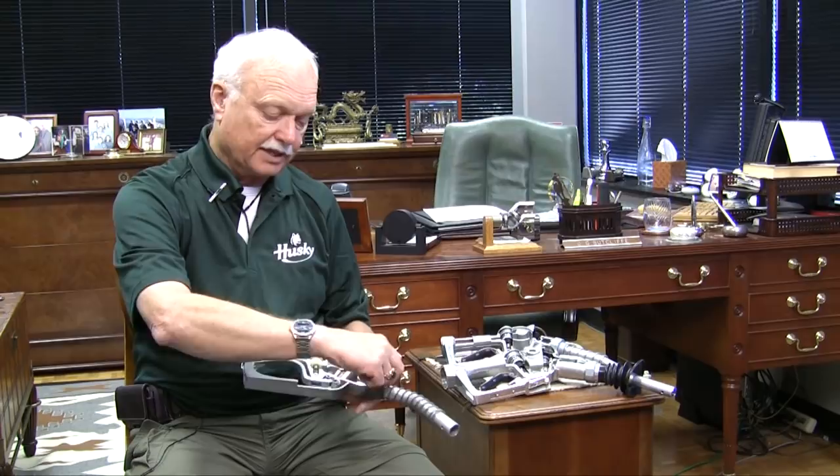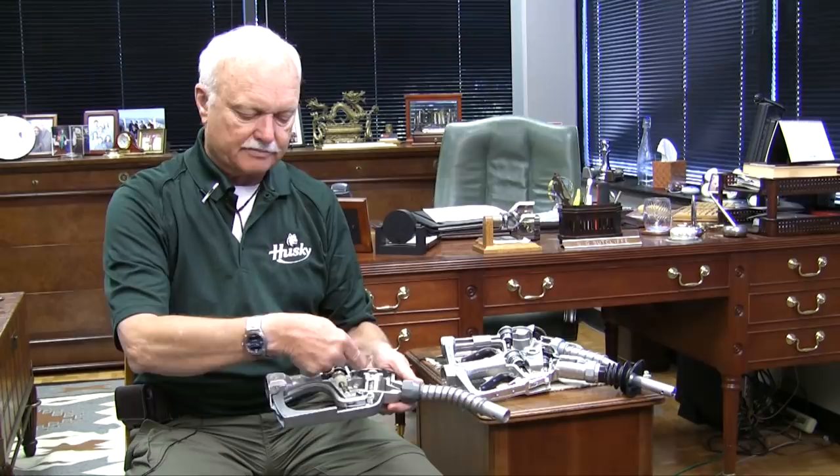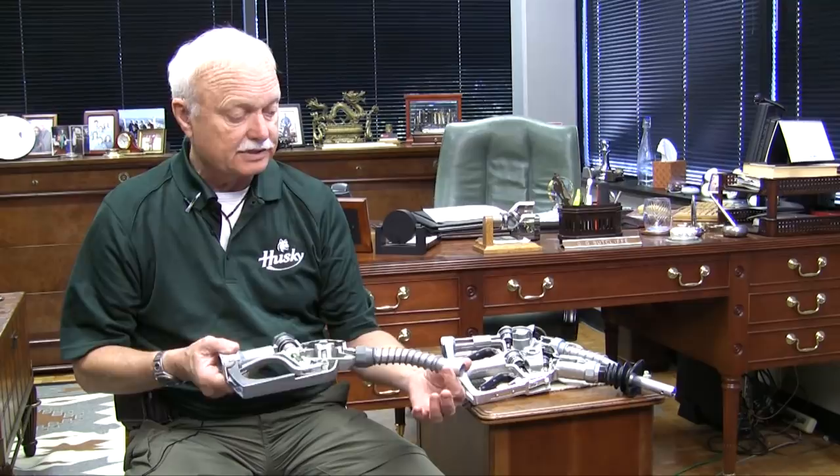Air flows through a black tube through the inside of the spout, up over the diaphragm, down into the venturi, into the fuel and out. So as gasoline is flowing like this, there's a continuous flow of air back through here like this. When gasoline in the vehicle's tank comes up and covers the sensing port, that flow of air is shut off and the diaphragm is sucked up, shutting off the nozzle.